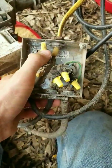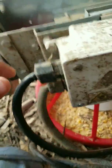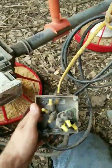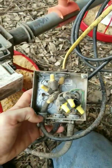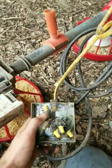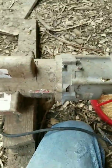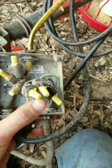This one right here - the yellow from the top is my incoming power. And then this one going out is going directly to the control pan. So that's the top line going into the control pan, and that's what gets power first. All that coil right there is the wire from the control pan. They actually give you enough so that you could set this up in its own box up high and out of the way. That's just the communication between the control pan and the motor.